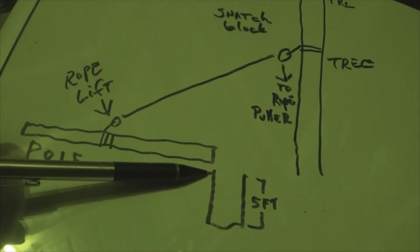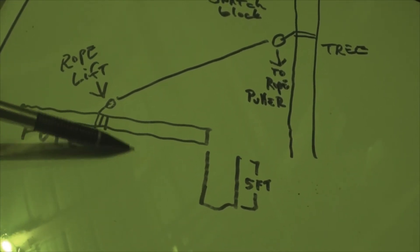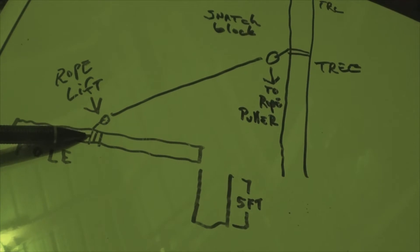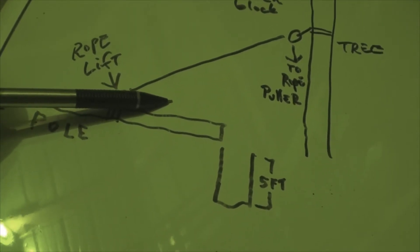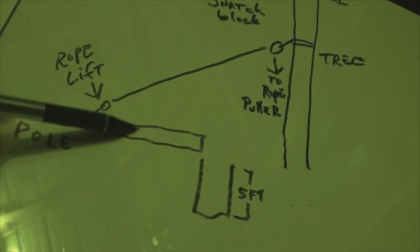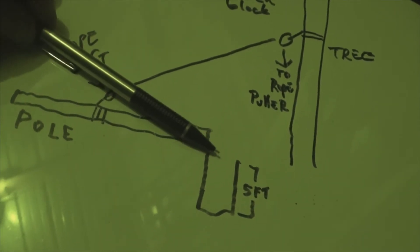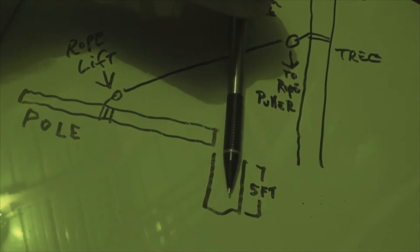Right down here — I don't show this in this drawing — I excavated this down about 10, maybe 11 inches, not quite a foot but very close. So that as I started to lift, this piece right here would start pivoting up to fall inside. What I did in order to get this to go ahead and fall was I took some rope, I wrapped around this, and then I wrapped around a stick — actually a pretty substantial, like 3-inch diameter oak. I lashed this to the stick, I twisted it, and it fell right down into the hole. What had happened was the butt of the tree right here slid into this, and as I lifted it up it was pivoting right here. So when I twisted it, it then fell into the hole and came into an upright position.